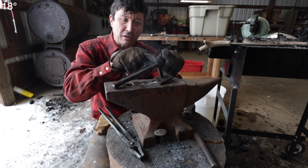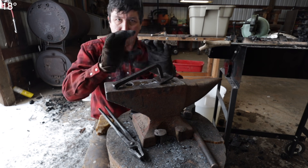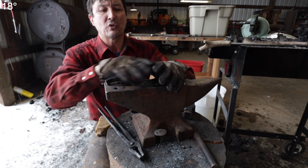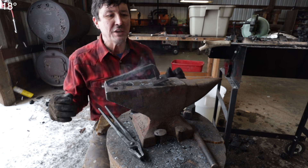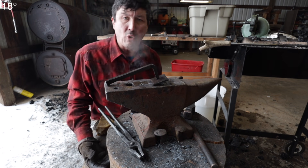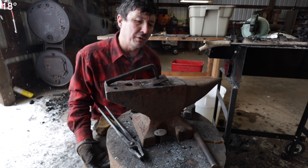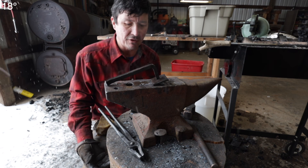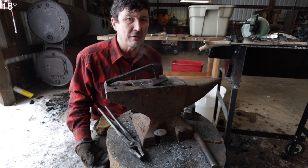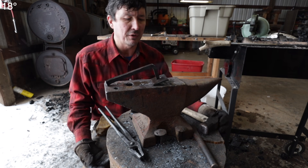If it's not deep enough, I'll go in the wood shop and make a little decorative square block just a little bit bigger, and that will extend it out a little bit — it would actually look really nice. Heating up the anvil, I think, helped. Things went better — I got a hole punched real quickly this time where last time it took me three heats. So there are little improvements that make a big difference. Having a proper anvil and a propane forge would go a long ways if I was going to get serious with it.